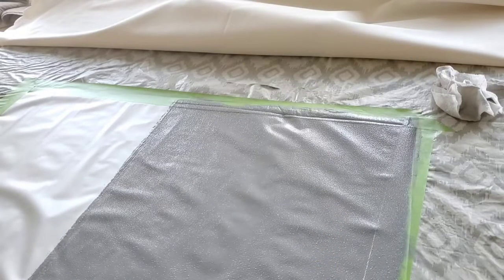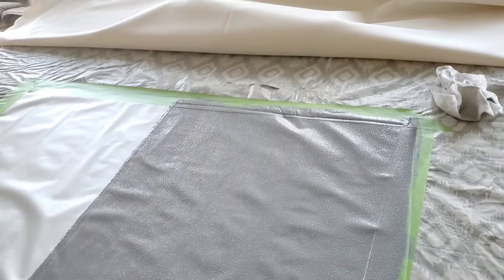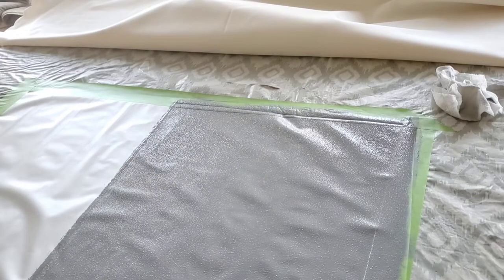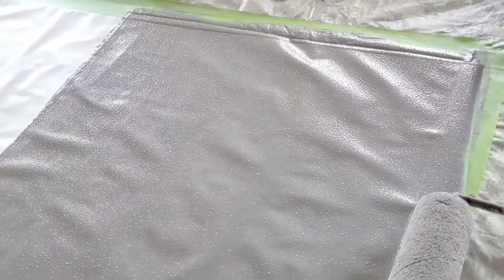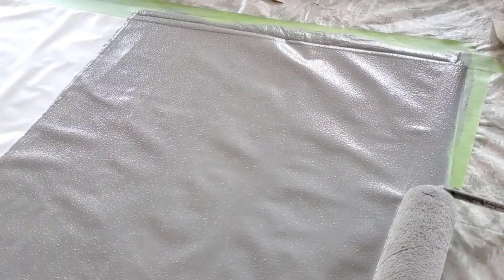You want to make sure that the material is wet on the screen, right? You don't roll any dry areas, which is no doubt where Silence's issues stem from. Because when I saw the video, and you could see on the right-hand side whenever he got up close, those marks are marks from the roller being dry. And then you coat over it with another coat, and that's just going to show up as a matted area underneath the top coat. So it's going to look darker because it is more matte.